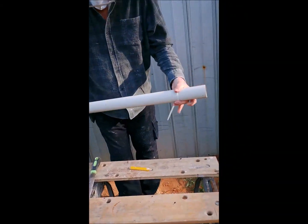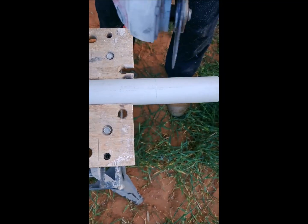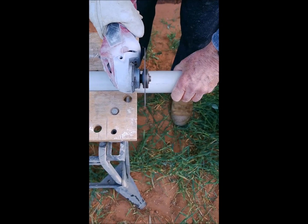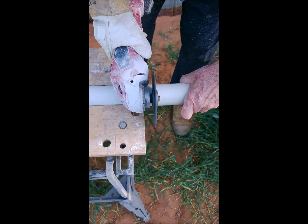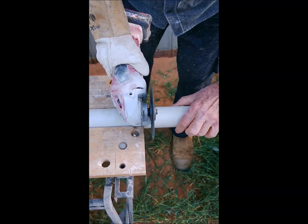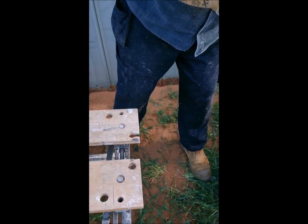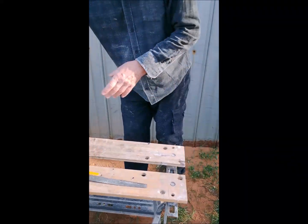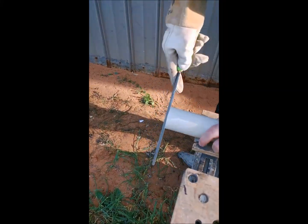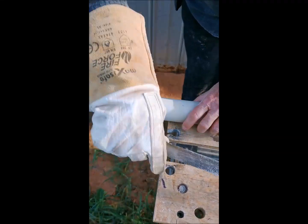It has a 50mm — you can do the same thing with it. Starting angle grinder, here we go — minimal fuss. And again, just smooth off the end and bevel it so that the pipes fit well.